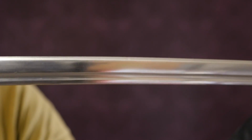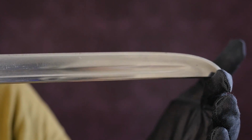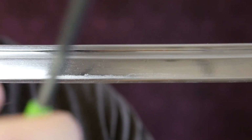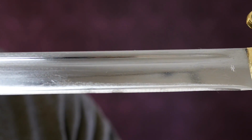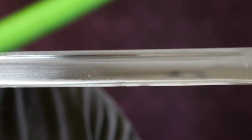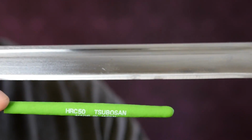The blade is made of EN9 steel, which is a medium carbon steel. It has a carbon content of 0.5%, which makes it somewhat on the soft side, at least by modern standards. And since the website doesn't tell which hardness the blade is tempered to, I wanted to find that out using these testers here. In fact, I've already done that. You can see the marks right there, but the camera was not recording meanwhile, which is always great.